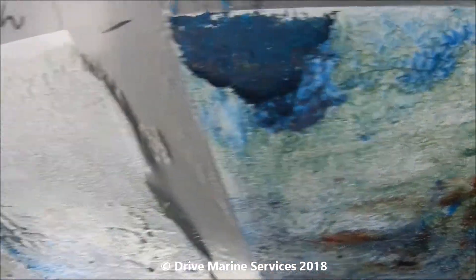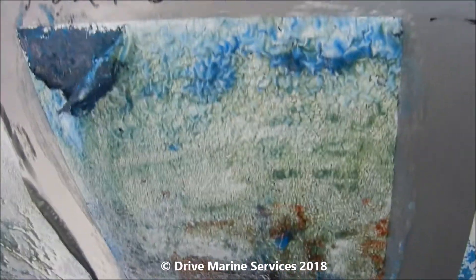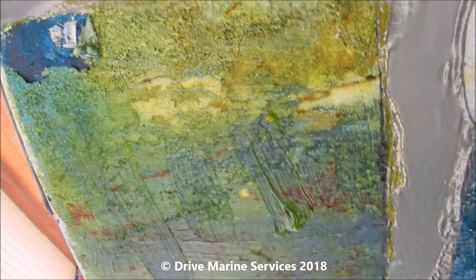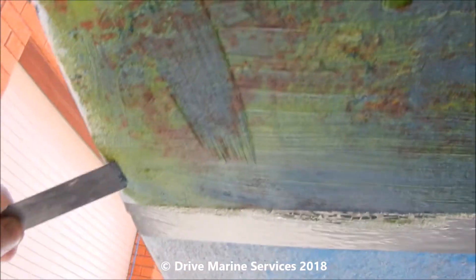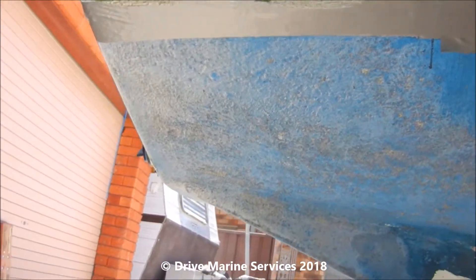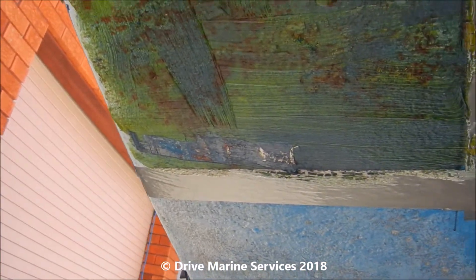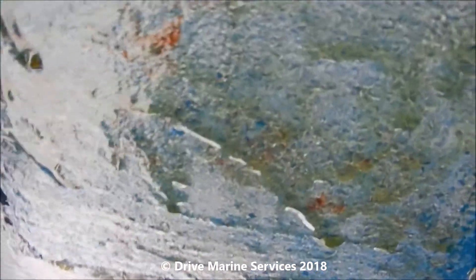It's now midday and we've had the paint strippers on for an hour. Looking at the poly stripper, there's quite a bit of red coming through; the orange peel is just starting to come through; and the lemon peel has come through quite a bit as well. We'll do some more scraping on the other end. Doing the lemon peel first — it's just starting to come through but still a little hard to scrape off. My concern is that the lemon peel is drying out — it probably needed to be applied a bit thicker.